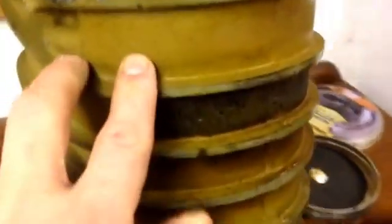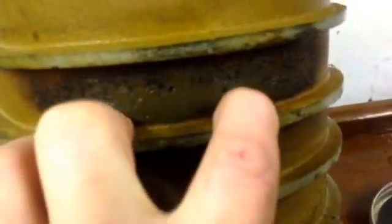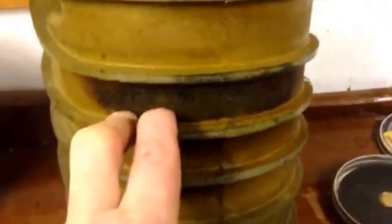I'm wondering if X800 is what caused this damage here — I don't know the history of this heat exchanger. This here doesn't really surprise me; there's no real depth to it, it's just starting to bake a bit of scale on there. Nothing that would obstruct. It does suggest it's possible that X800 is affecting that area. It may also be cavitation, or it may be bad casting, but that's an awful lot to be bad casting because it continues all around there. Actually, I'm scratching my previous statement — use X800 for a week. I've never actually failed with that on one of these.